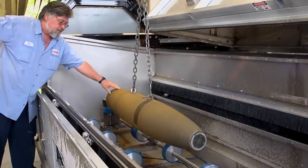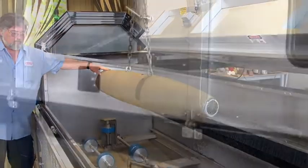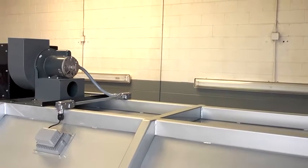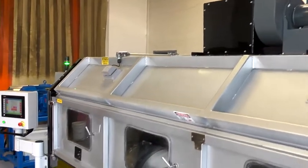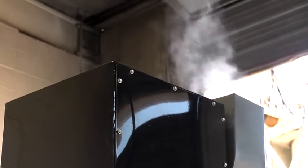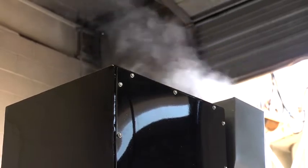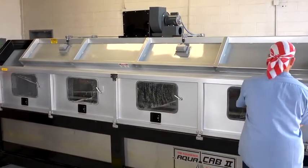The loading and unloading of the RBB is done through the top with the front door down. This allows heavy objects to be loaded from above with an overhead crane or forklift. Incorporated into the top are two 20-watt LED lights to assist in viewing the interior cabinet space. Also located on the top is a 1,000 cubic feet per minute exhaust system, which can be attached to an existing stack system of a plant or left unattached.